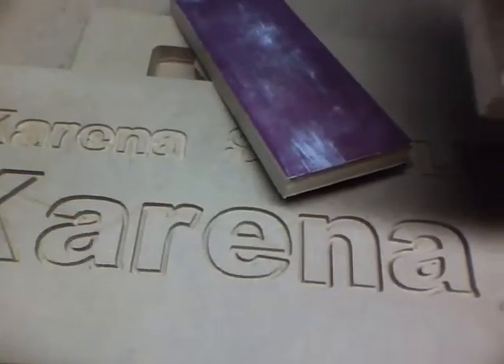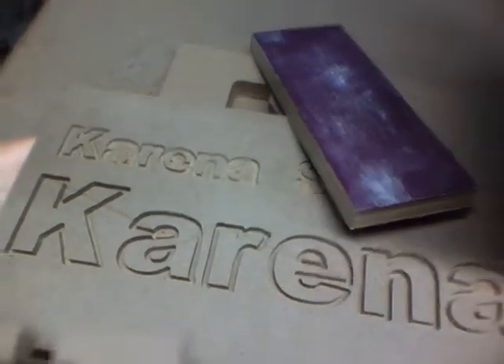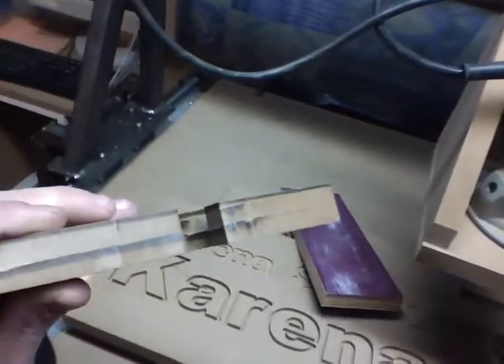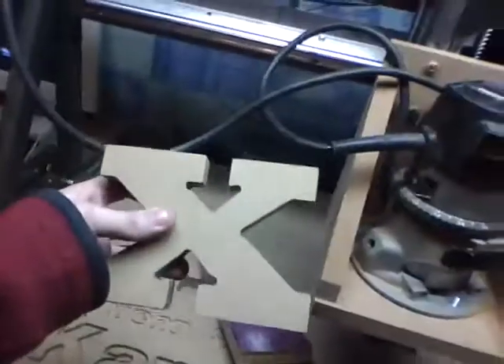A spiral upcut bit is of course the way to go. But I live in the middle of nowhere and there's not a place to buy spiral upcut bits right around the corner, certainly not on a weekend. There's one place on Cape Cod here where I live where I think I can get bits, so hopefully Monday I can get a proper bit. I do have this little spiral bit, but unfortunately it didn't have the depth I need to get all the way through the three-quarters. I used a quarter-inch straight bit to get all the way through, and it was just not correct, and it also led to a lot of the flexing. But I got a giant X out of the deal, which is cool.